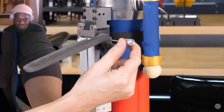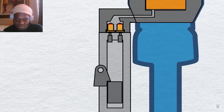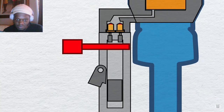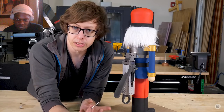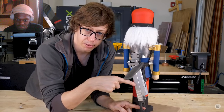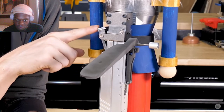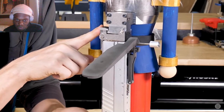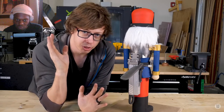The first thing we have is the safety stick. This physically prevents the nutcracker lever from being depressed. It also goes inside of the nutcracker and physically blocks the hammer from reaching the shells. So even if you somehow release the hammer, it just can't go off. If the slide isn't fully shut, it blocks the hammer as well. And the slide can't be fully shut unless the breech is fully locked. This prevents it from being triggered with the breech partially locked or open, which could be really dangerous.